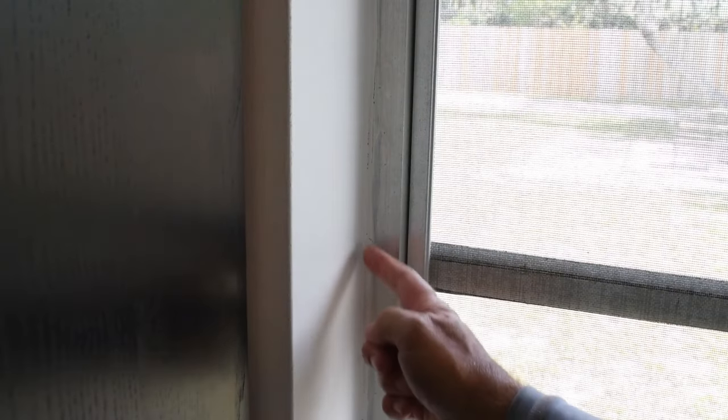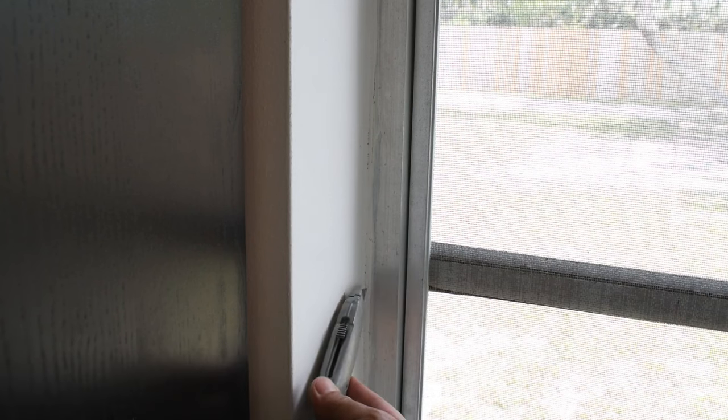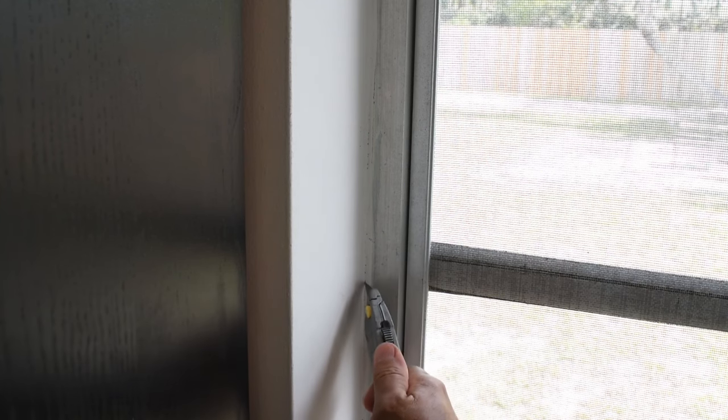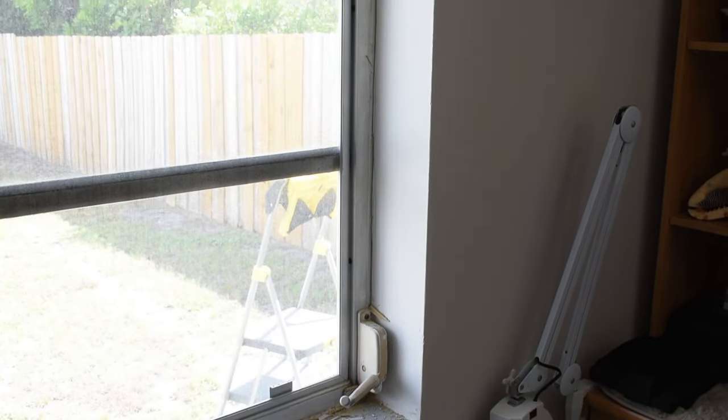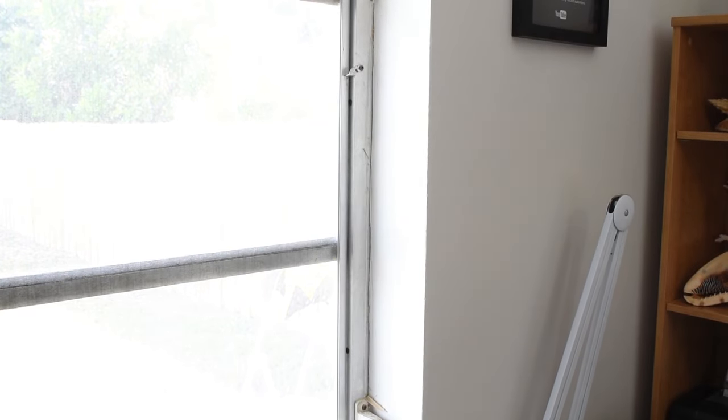Over here is the caulking bead that I want you to cut on the inside all the way around. You're not going to hold the knife straight in or flat — this corner is 90 degrees, so you want to come in at 45 degrees. Go all the way in and push down just like that. Make that nice clean cut all the way around and the sheetrock will not be damaged when you remove the window. You can see the corner's been cut nice and clean all the way to the top and all the way around.